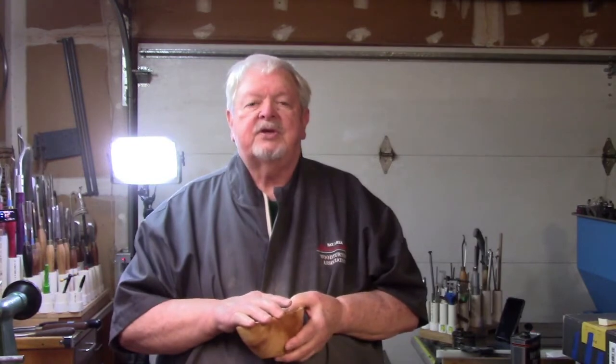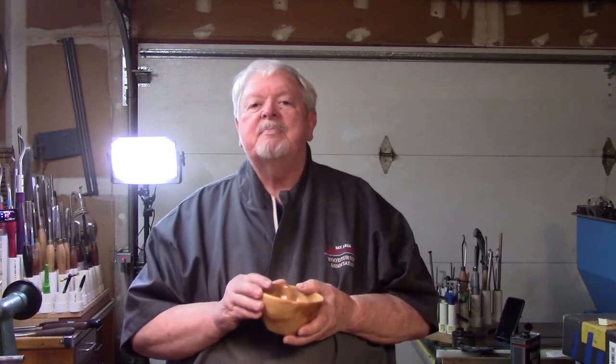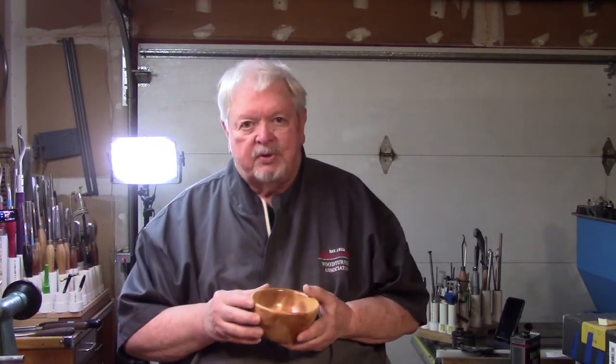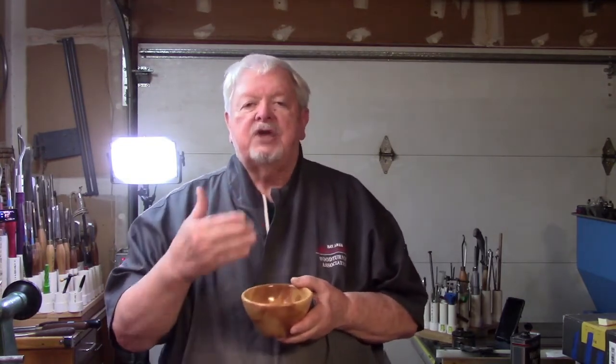Our next lesson, lesson number 3 in this series, is going to be focused on doing the same job but absolutely backwards. Instead of turning the bowl and creating this kind of shape here, we are going to do what's called a natural edge bowl, in which case the bark edge of the piece is out, and it will have a sinuous shaped curve to it. It requires some centering and some alignment issues early on. And also with the wings standing up, they become very difficult to turn because we're turning air, and then some wood, and then some air, and then some more wood.